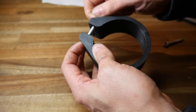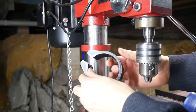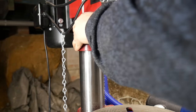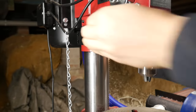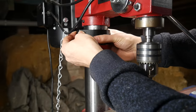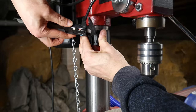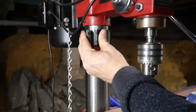Not so tight that we need to press the nut in, but the cutout is small enough to stop it from rotating when we don't want it to. Now for the not-so-sure part — will it fit around the post? It did have a bit of flex, but I still wasn't that confident. However, with a little persuasion, I was pleased to find that it finally snapped into place. Honestly, I was lucky to get this right first go. The next question was whether it would flex close enough to clamp tightly on the pole — and that was a yes. When clamped that tightly, I measured 7mm between the two inner surfaces, and I found that 7mm would be ideal. I couldn't design any further without that crucial measurement.